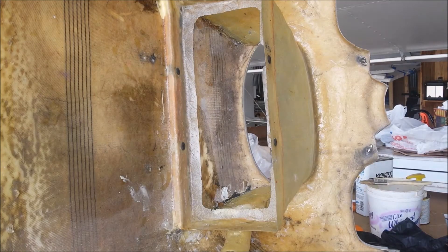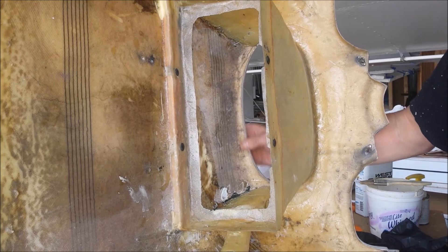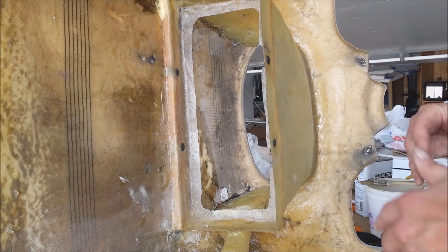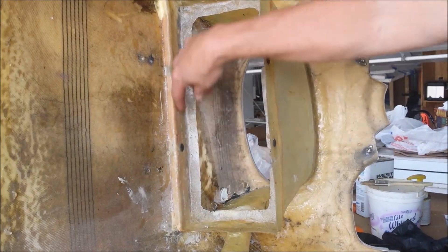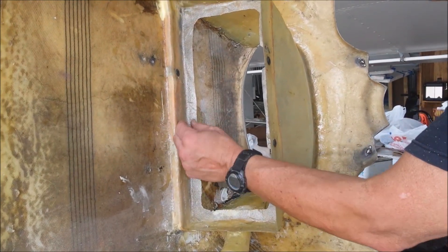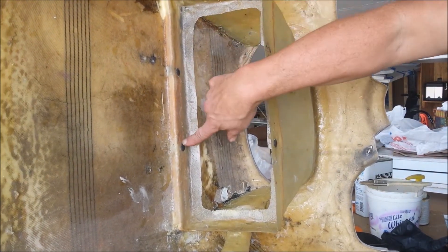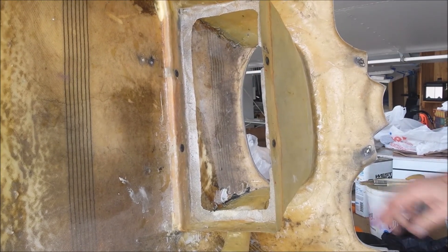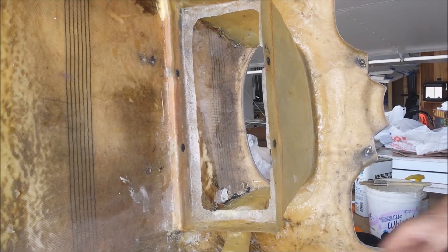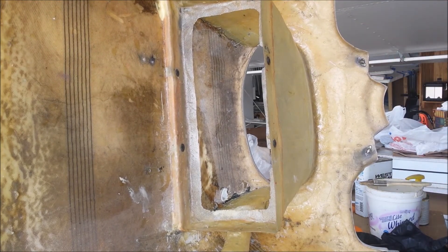As long as I've got it off and we're doing fiberglass, this is what I did — how I modified the inlet. The original inlet was just this lip, and the radiator kind of just sat in the breeze behind it. I created this duct — there are some wood wedges under here to get the right angle. And then the mounts here and here for the radiator, some holes for the oil cooler brackets, and then this for the heater, which I started and got stalled on. Got to get back to that.